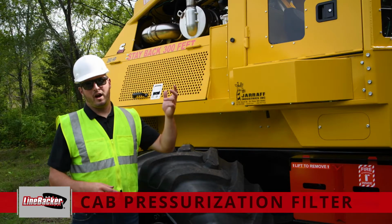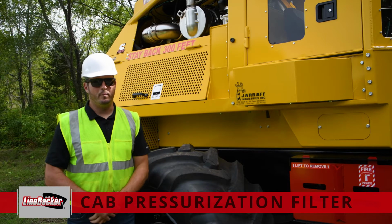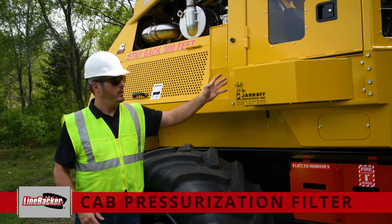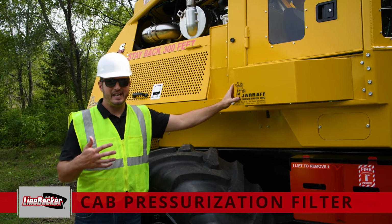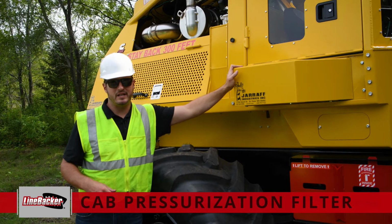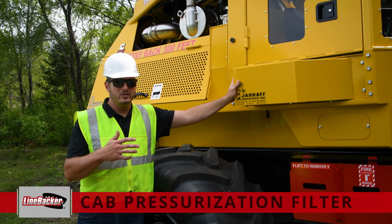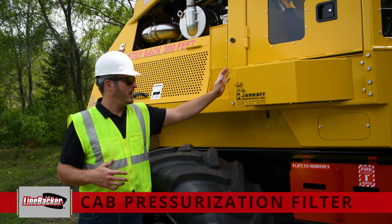Now on the right side of our machine, we have our cab pressurization unit. When Mark was touching on that, he was referencing the filter that's inside of it. With all of our filters, it's about being sure that we have nice clean air flowing into whatever component it is. The same goes for that cab pressurization. We want to be sure that's essentially on 24/7. So that's going to be taking air from the outside and putting it into the cab through the filter.